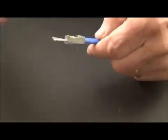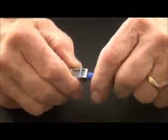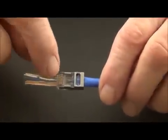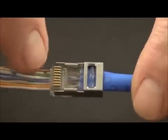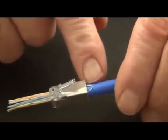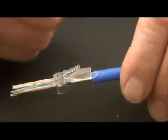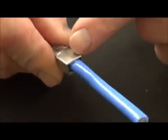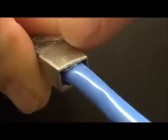And that does not take away from certification. So once I've done that, now I can put it in there and continue to set it, and then I'm going to fix the wire at the back end, which is going to be my ground. Remember, we're doing Cat 6 here, so you can see maybe the end of the jacket showing up there, coming in from the back, but we need to get that almost up flush to the back of the contacts. So I'm going to finish putting it on, and my ground wire is on the back side where the spring leaves are for the internal ground, and that will go along with it and sit right there on top of those leaf springs, and then we should be ready to terminate it. Here's the back end — you can slightly see my ground wire. I looped it and foiled it around, but you can see it right there at the back end. It's sitting really nice on those springs — it's going to be a good ground.